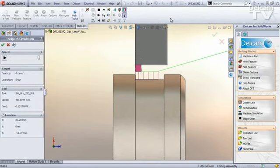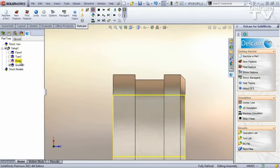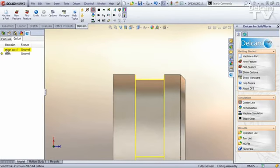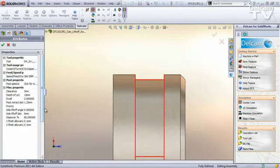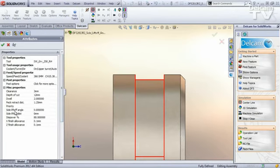So this is not desirable. It does tend to wear on the tool and diminish the quality of your finish. So there's a new parameter now. If you go to the groove operations in the op list, you can either left click or right click to go to the attributes of that particular operation, and you can see down here a new parameter called side lift off angle, and it's set at 0 degrees. So the tool is going to plunge straight in and then retract straight out.